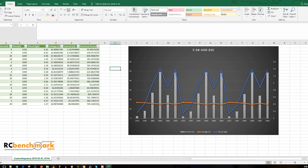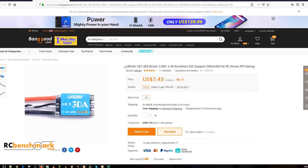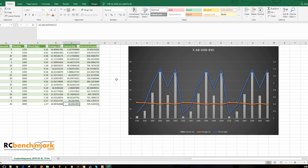Overall everything is looking pretty good. If another ESC can't handle this test, it isn't really well designed — and a cheap ESC can handle very well if it's designed great, and this one just did. The motors I used were the F80s, the latest F80 2500KV, with GemFan 5152 propellers — the most insane combo I could think of. I could have used six-inch props but King Kong props always disintegrate, so I used a well-named branded prop and it didn't disintegrate. Let me know what you think in the comments, and I'll leave you with the thermal imaging video and the long stress testing footage.